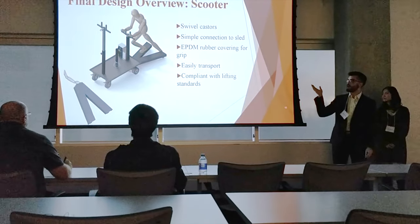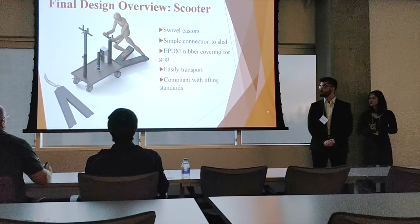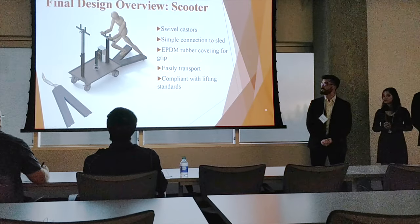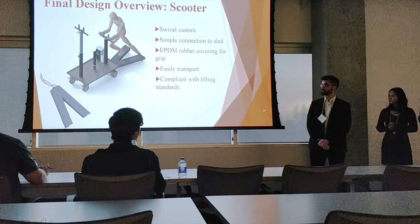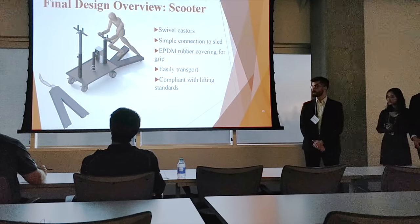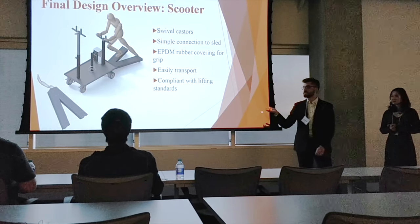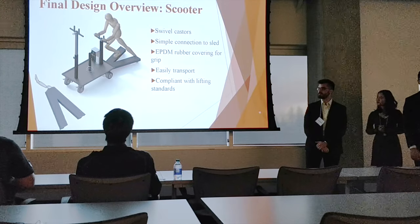Here is the final design of the scooter shown in position on the sled. It is made of two aluminum channels connected at an angle to achieve the client-specified Y-shape, supported by three low-profile cast swivel casters for smooth travel without concern of minor misalignment. It connects via a pin on the underside of the front of the scooter. One important design consideration was ease of storage: the scooter can be lifted up at an angle from the front and moved to a dolly, supported on the rear casters. Additionally, the scooter can still use the handle of the sled.